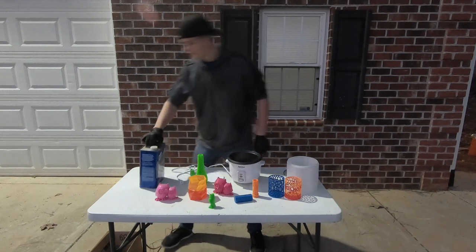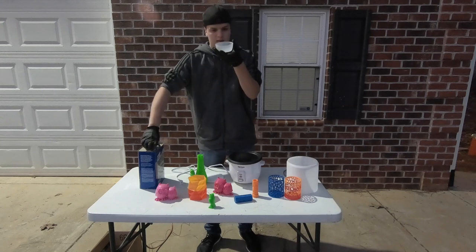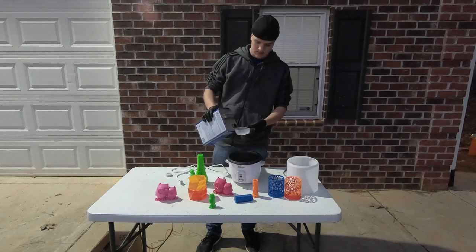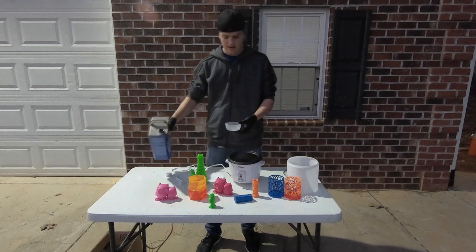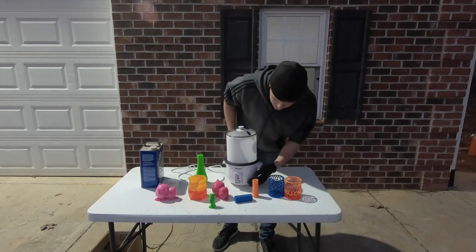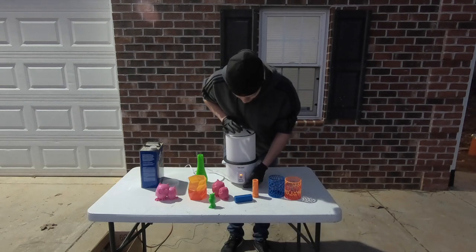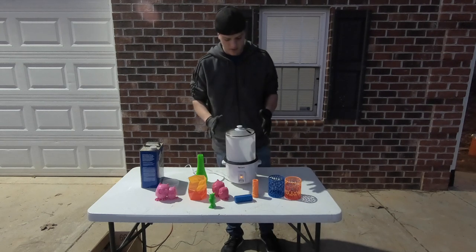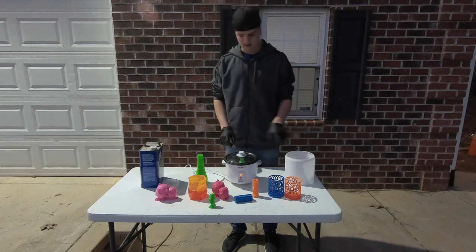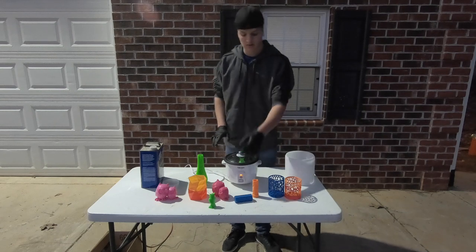Take some acetone — this thing came with a measuring cup, and this is polypropylene, so this doesn't dissolve in acetone. I'm gonna pour out about a half cup to a quarter of a cup, put that down in, and then go ahead and start it. Keep this away from any open flames unless you want to kill yourself. It seems to work best if you turn it to cook — then you hear a boiling — and once the vapors start condensing on the top of the lid, then you can turn it to warm.